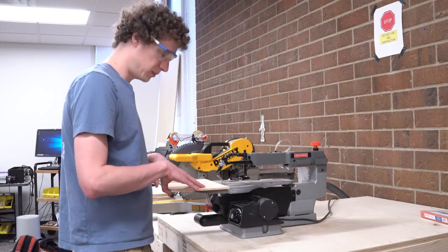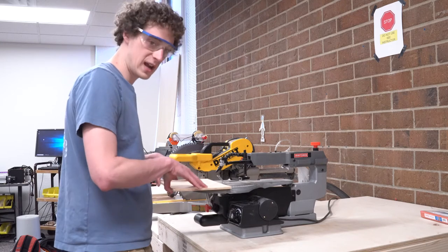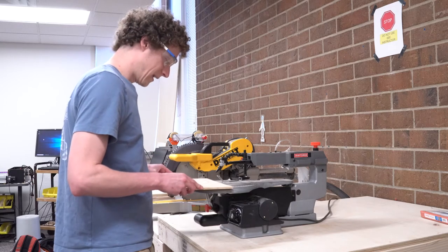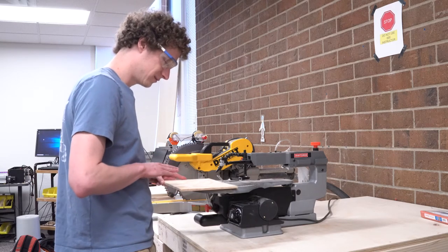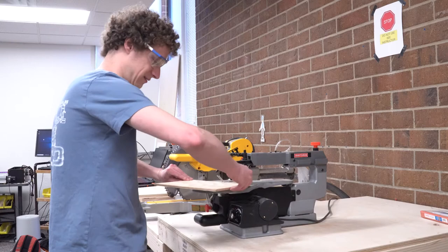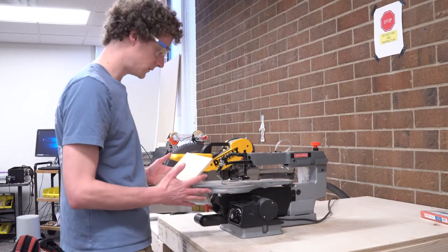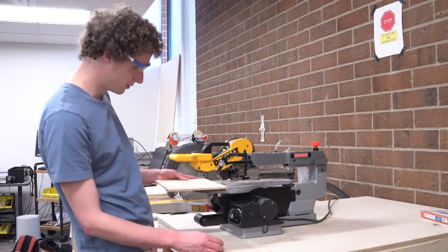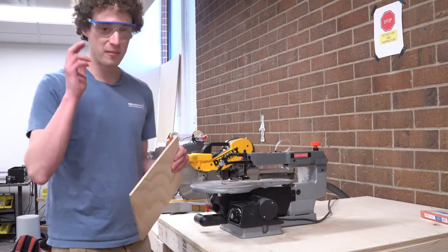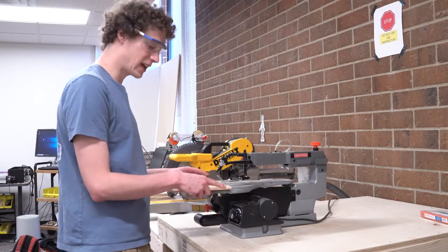When I'm cutting a piece of wood — and this is probably the most important part — you want to keep your hands out of the way of the blade. There shouldn't be anything directly in front of the blade as you're cutting. No matter where you're moving the wood, keep your hands out of the way of the blade, so in case you slip, your hand doesn't go into it. It's a pretty easy tool to use. Before we even turn this thing on, definitely remember to have your safety glasses on to protect your eyes.